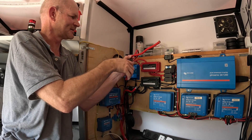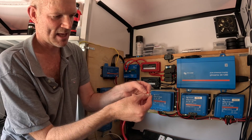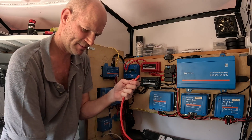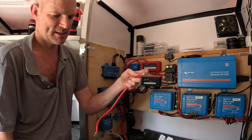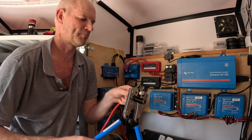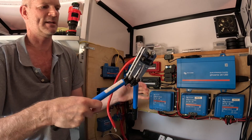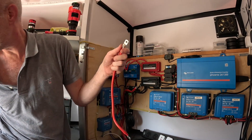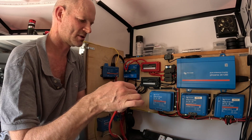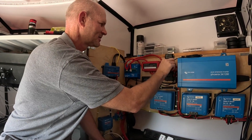I need a 25-mil section, so I'll put a mark on it before I lose my place - I hope I get this right because this is the only bit of cable I've got left and I don't want to order more just for this. I'll take the end off, separate the cable, move the crimp box so I don't knock them everywhere, and into the crimper we go. One end crimped - next a bit of insulation tape, because I don't have heat shrink of this size, just to clean up the end and reduce the amount of exposed terminal.